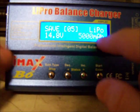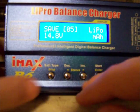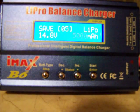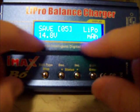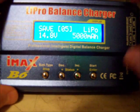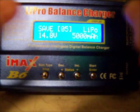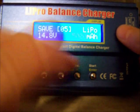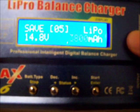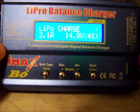And you set your MAH. Basically, the reason they want you to do this is because when you plug in your LiPo battery and go back into your load data, you can put it in your LiPo sack — which I highly recommend getting. They are $14 and they can probably save your house if your LiPo ever went off. What this does is set it so when the battery gets full — and it has a very loud buzzer, I'm telling you it is very loud and obnoxious — once it reaches that peak MAH, it will completely shut down the charger and charging will stop. So in this case it is a 3800 MAH battery — you just hold in this key and drop it down to 3800. It is flashing at 3800 MAH. You would hold the enter button.